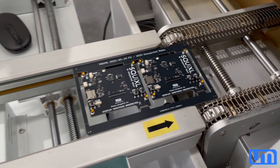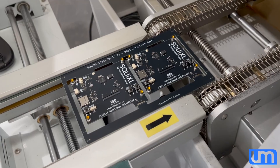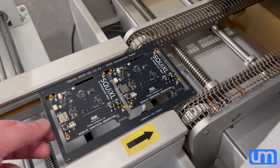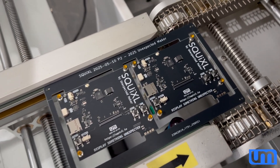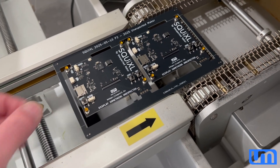The connector's been nudged, and now it's going into the oven. Unfortunately, it's not going to continue by itself because of the gaps I put in the routing — the sensor is right there. So the sensor thinks there's no board there because of the routing edge.